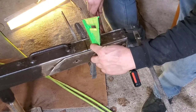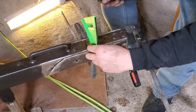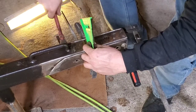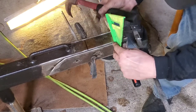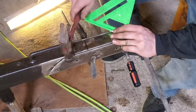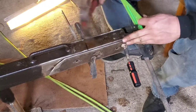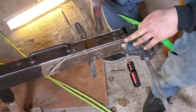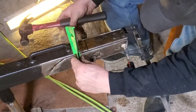The wind is going nuts out there. Getting the other side lined up — coming up just a little too far, adjusting it back. There we go — that's pretty good. Now we're going to bring them up flush with the top and double-check that the front side is still flush and even. I'm giving myself just a little room to be able to stack the weld on top so we don't have to grind all the way down to the flat stock — leaving a little rounded edge to ensure we get a good flush fit with the receiver.